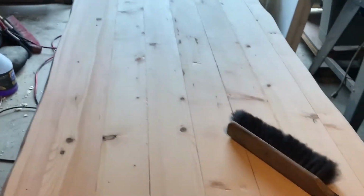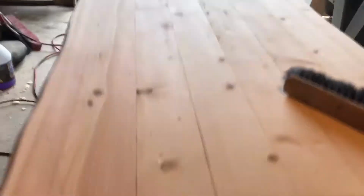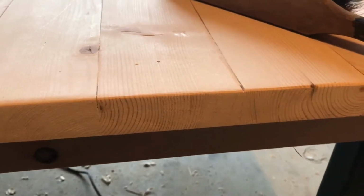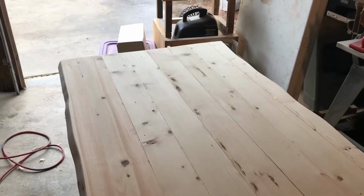To begin with, they wanted the beat up old rustic look. So as far as stuff like this right here, I'm just gonna leave it. There's a little spot there, and there's some stuff down there. But for the most part, it came out pretty good this time. Like I said, you got to pay attention to the grain. Make sure that you flip-flop them like you're supposed to, which I didn't do to begin with, and man, was it cupped. So, yeah, let me get back with you.